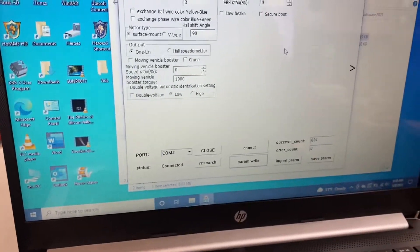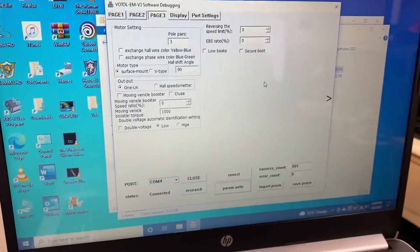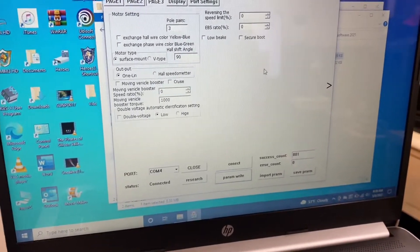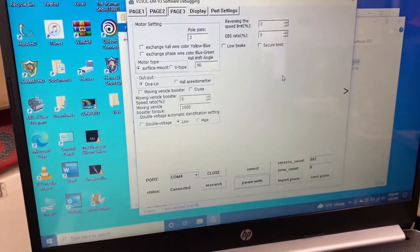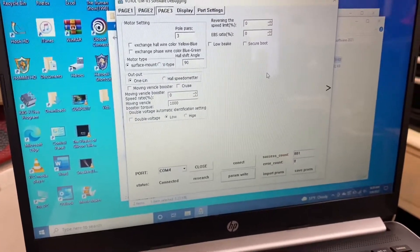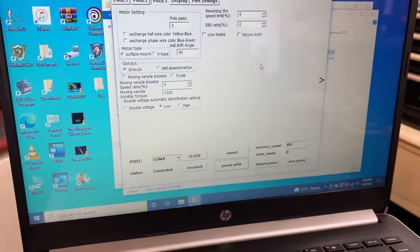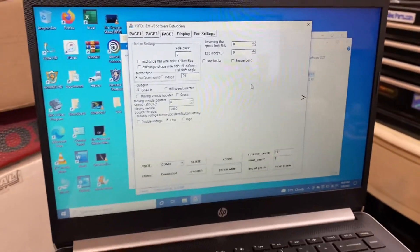The hall angle I have set at 90 right now, which doesn't make any sense, but the auto-identify came up with five pole pairs and a 60-degree hall angle and it ran like complete crap. It seems to run better at around 80 to 90 on the hall angle, which doesn't make sense — it should be 60, 120, negative 60, or negative 120. If I try to exchange any of the hall phase wires the motor completely locks up, so this is the only configuration that actually spins it, but it's still not solving the issue.